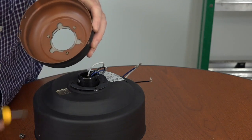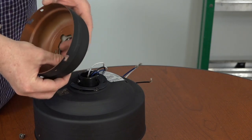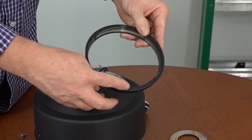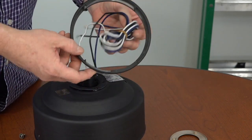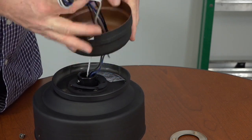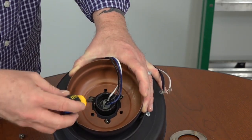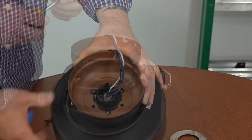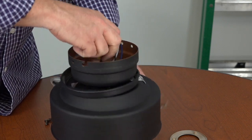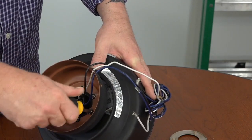Next, remove the decorative ring from the bottom of the canopy — it's held by three studs inside the canopy; press each stud with your thumb to remove it. Feed the wires through the canopy ring, making sure the slot openings face toward the ceiling and the smooth side faces toward the motor, then place the canopy ring on the motor. Feed the wires through the smallest opening of the canopy so the largest opening faces the ceiling. The notched cutouts inside the canopy align with the remaining screws and screw holes. Secure the canopy to the motor using the three screws that were removed and saved, and completely tighten all three.